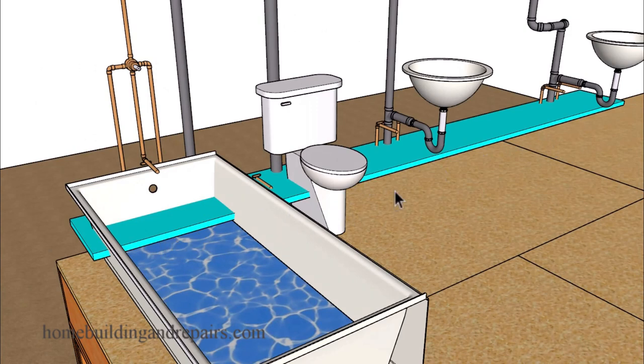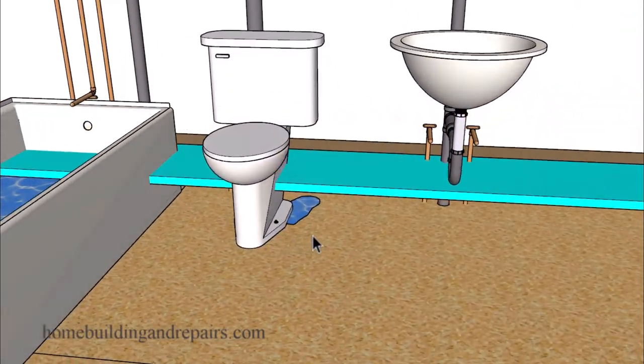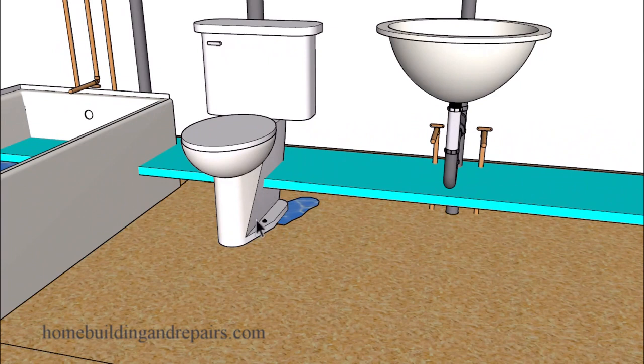This line represents the top of the water level in the pipes. This is why you don't have water coming out of the bathtub or the sinks — it's going to come out of the lowest spot possible, which is usually going to be your bathtub, your shower, or the bottom of the toilet if the seal isn't working properly. This actually happened to me about five or six years ago and I did not have any clean-outs to open.